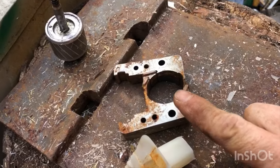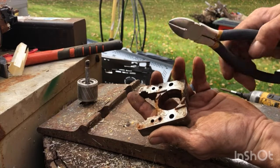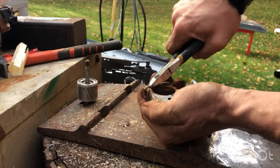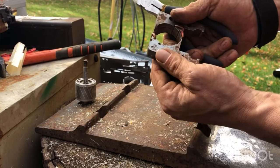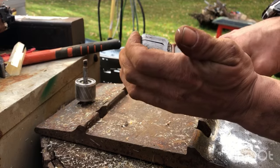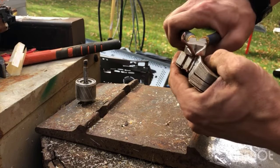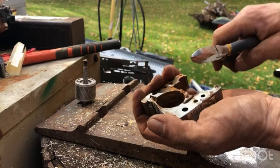Beautiful, beautiful. There's a little bit of copper still left in these guys. That is really easy to take care of. Now you'll just want to take a pair of side cutters and give that copper wire there just a nipperoo, and then that'll fold over. They usually break off pretty good. They're kind of partly welded on. That's what holds it together there. Just give her a little bit of a twist-a-roo, bend her over. Sometimes, if you're gentle enough, you can just work that copper out with your nippers without cutting through the copper.